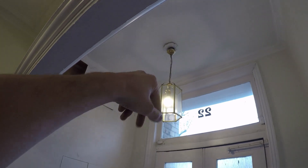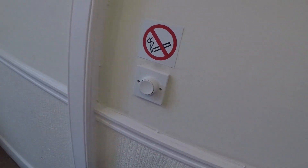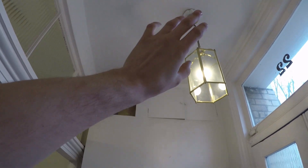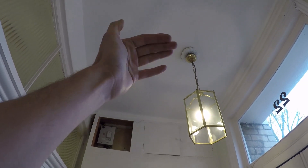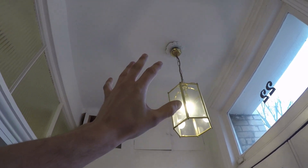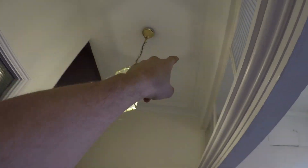They want a full fire alarm system and emergency lighting on all floors. I'll walk you through floor by floor and you can leave below what you think, how long it would take and your price to do it. So up here is the entrance. We've just got a normal light there, activated by push buttons — old style pneumatic time switches. We need to put a normal light fitting, but maybe it'd be easier to just take them down and put drum lights with emergency lighting and battery backup built in. It works like a normal light but with battery backup. Personally I think that's the easiest way forward — one there and probably one here as well. We'll need a smoke detector over here and another one over here because of the drop separating the two areas. These walls don't look hollow, so it might be a question of just running trunking neatly — doing the whole system in trunking perhaps.